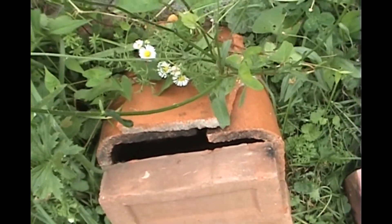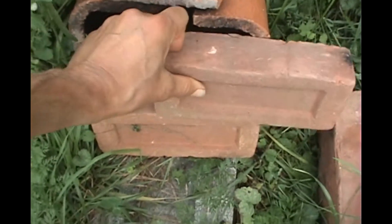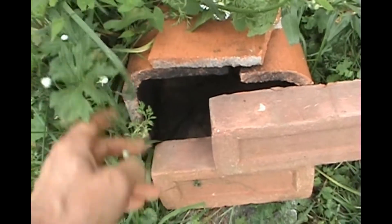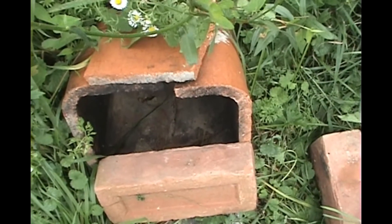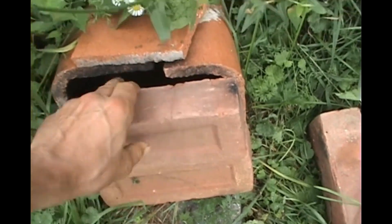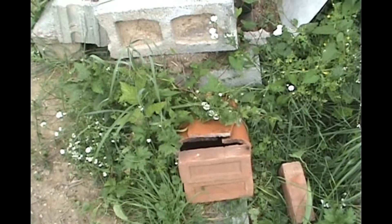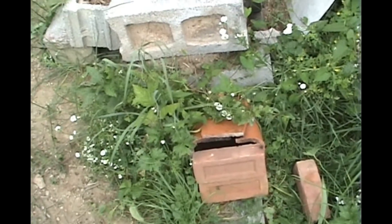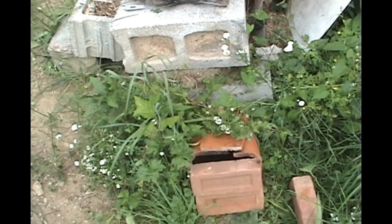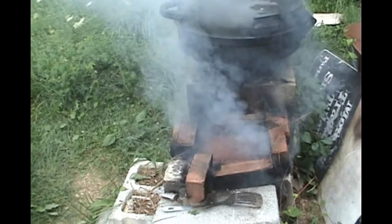Temperature is regulated simply by setting two bricks in front to allow a small air vent. Sliding one brick across turns it up to 500 or 600 degrees. With both bricks off and the throttles open, you can easily achieve 1500 degrees in the oven — possibly more. It's probable you could use it as a kiln, though the grill piece likely wouldn't last long at those temperatures.